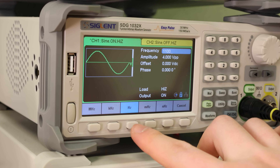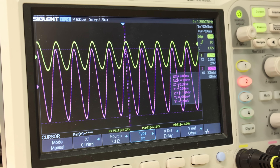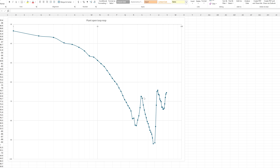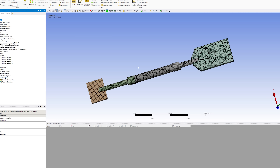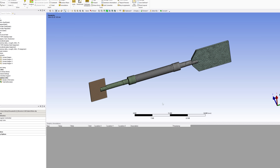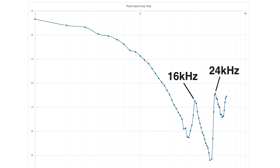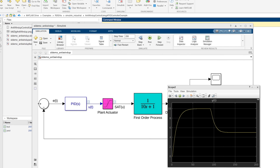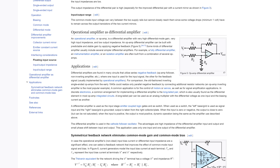First, we had to measure the open loop response of the galvo actuator. We did this by feeding the amplifier a sine signal from 1 kHz to 96 kHz with 30 PPD resolution. We then manually recorded the response amplitude and phase to create a plant model. We noticed resonances at 16 kHz and 24 kHz and assumed this was caused by the flexibility of the motor shaft. To test this theory, we constructed a finite element model of the motor shaft. By computing the eigenvalue and eigenvector of the mass and stiffness matrix, we were able to obtain the natural frequencies and mode shapes of the shaft. As expected, the natural frequencies of the second and third torsional mode corresponded perfectly to the two peaks in the frequency response. After creating and validating our plant model, we designed a controller in Simulink. The controller does most of the critical computations using differential signals, which would theoretically cancel out most of the noise.